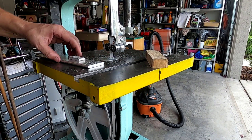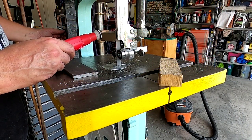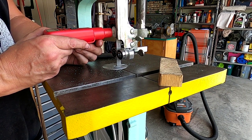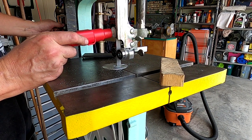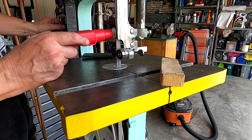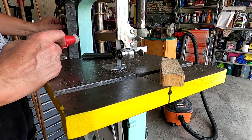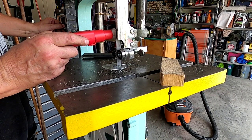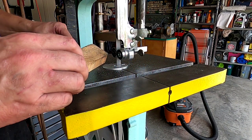Right through the aluminum like butter. Now I want to try some mild steel. Starting on the first belt setting at 30 Hz — we're turning about 90 surface feet per minute. At 50 Hz we're at about 150 to 160, and at 60 Hz we're at 200 surface feet per minute. I'm going to drop it down just a little bit and cut at 150 surface feet per minute. Let's see how this does.